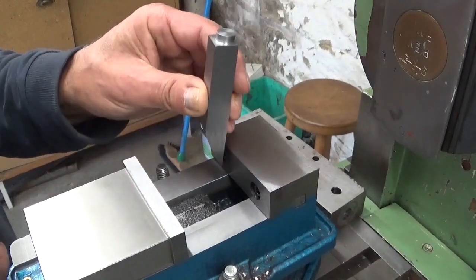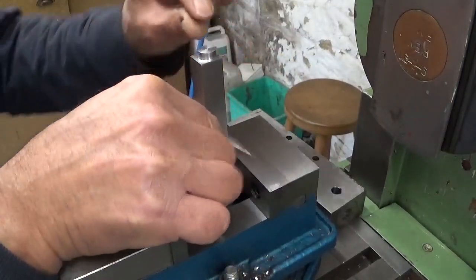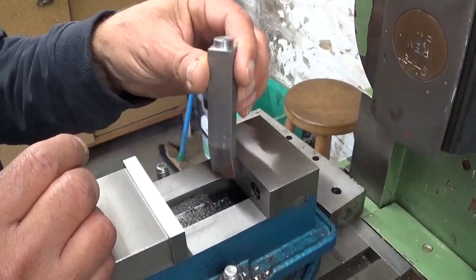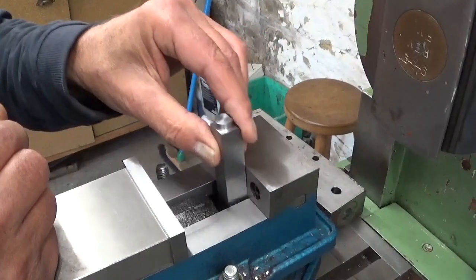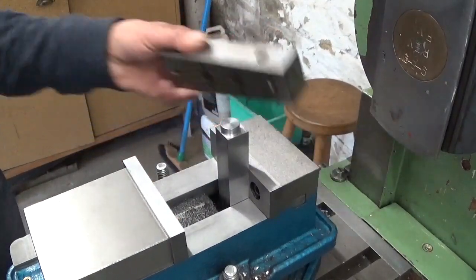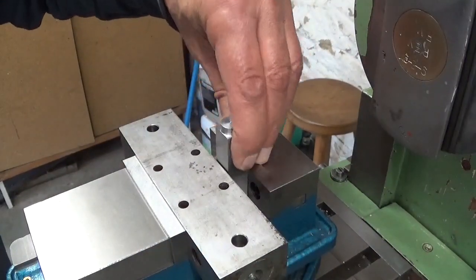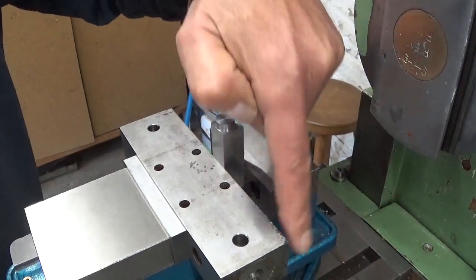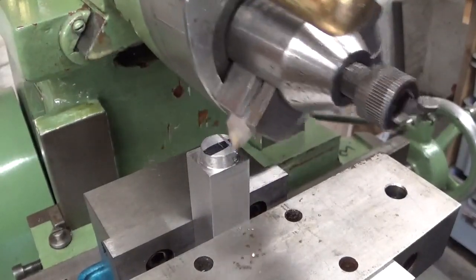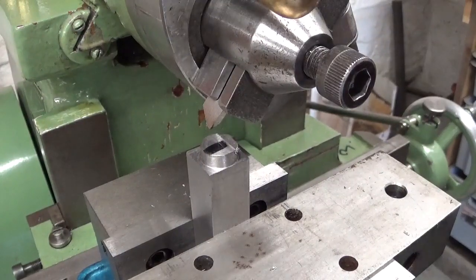To be able to see what I'm going to do, it should be good if I could install the workpiece like this and then cut this dovetail — the small one — here on top. Of course there's absolutely no rigidity in this direction, but if I can put it down here in this opening, that could work. There's this block in the way from the vise — it's going to pinch it. So if I use this one, which is square, put my part in here and square it up with the little machinist square, that could work. Seems to work.